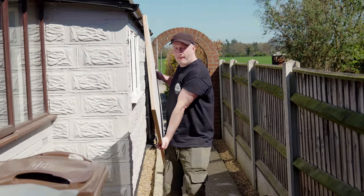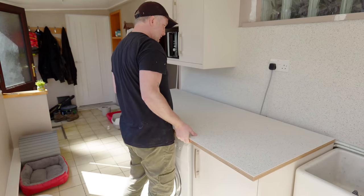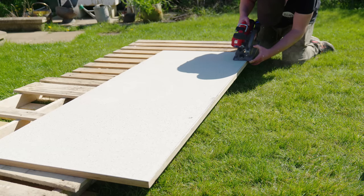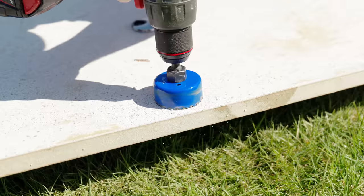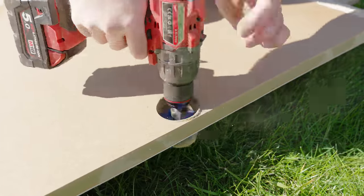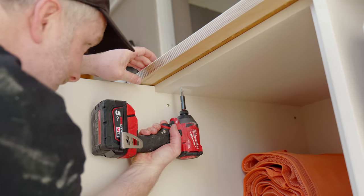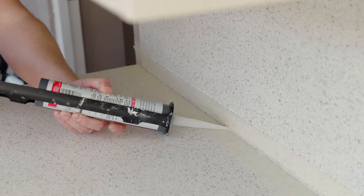Then I can bring it in, and this was pretty exciting because I'd put a lot of work into the kitchen at this point and the worktops are the final piece that will make everything look finished. I'm using my compass again to scribe the not-so-straight shape of the wall onto the back edge of the worktop, and then I can get that cut out with the circular saw. I drew the 60mm hole where I'm going to be fitting some cable grommets for the plug that goes up from the washing machine to the socket on the wall. That gets fixed in place with some super glue — I'll leave a link to these in the description box. I can then fix the worktop to the cabinet with a few screws from underneath and add a bead of clear silicone to the back edges.